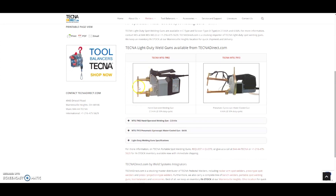It's got a dial for pressure selection and adjustable electrodes — this is a more professional unit used for welding repair, not really for manufacturing. I was talking to a guy from Tecna, the manufacturer, and he says if you use it a lot, the electrodes and the whole thing starts to overheat. That's why they have a water-cooled version, which has a higher duty cycle. Both models are 50% duty cycle, but the water-cooled one is better rated for more production work.